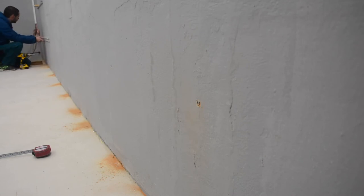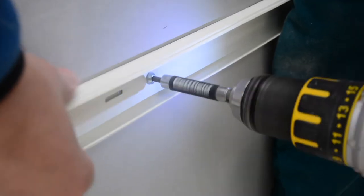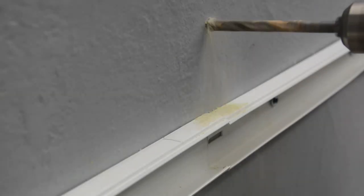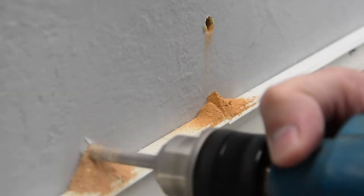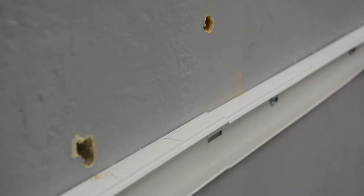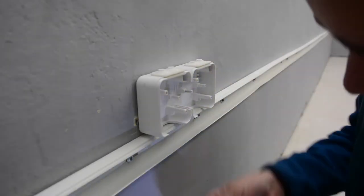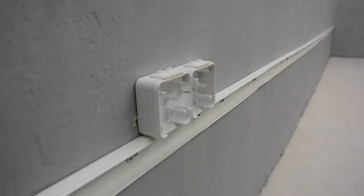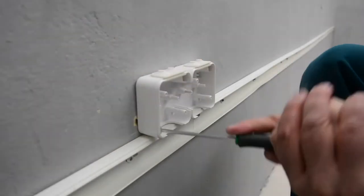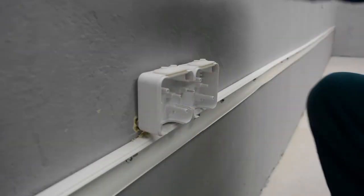For distributing the power socket cables, I'm using a plastic wire duct fastened to the wall with plastic wall anchors. The problem with these anchors is the quality of the wall — this old building has a classic brick wall with sub-par quality. The holes for the anchors have to be precisely drilled, otherwise the anchor will not hold, and it is not unusual to hit a gap between bricks. With the wire duct you can move a few centimeters and try a new hole, but when fastening a power socket you need to hit the right place on the first go. This is usually a source of great frustration for me.